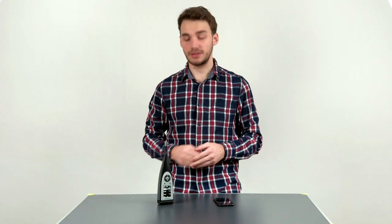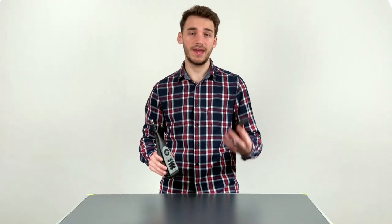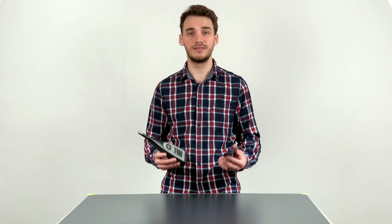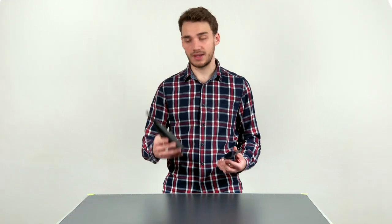Let's start by connecting your SLM meter to your mobile device. In this case I'm using an iPhone 8 running iOS 13. There are two ways of connecting: you can use a local Wi-Fi connection, connecting your device to the same Wi-Fi as the sound level meter, or a more secure and reliable way is via hotspot generated by your SLM meter.